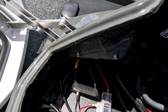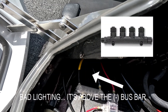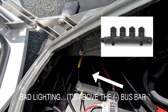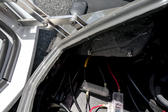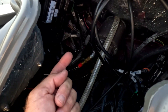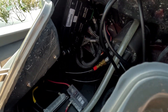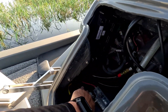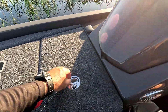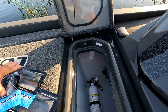There's also a NMEA port connected to the bow — I'm not going to take the bow back apart — but there is a NMEA port up in the bow, very accessible for whether you're running Humminbird units, Garmin units, or Lowrance units with any NMEA accessories that you might need to attach. And here's all the cables coming out of the back. I'm going to take that unit off and show you how you run cables through to get them through there. There's also an ethernet cable, because this unit here is talking to those units up there. I didn't have to drill any holes to get that run through the boat — I fished it down through here and ran it up underneath.